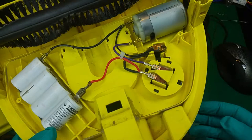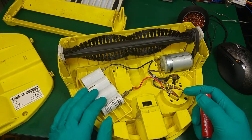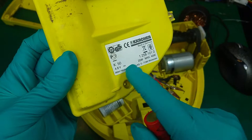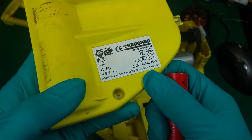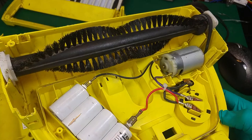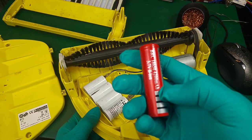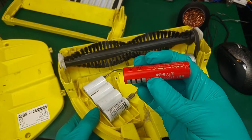So I'm wondering if I can replace this with a lithium-ion cell. The problem with the lithium-ion cell is that we've got a slightly lower voltage, because the nominal is 4.8 volts and here we've got 3.7 volt nominal, so we've got less power, less current, and less speed. But I think that will be okay, and I would like to use it because we've got overcharge protection, over-discharge protection, and overcurrent protection — three things that are the most important.